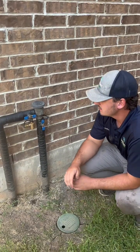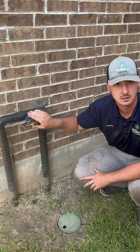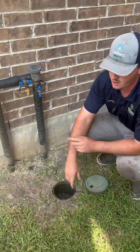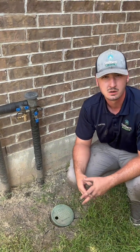What not to do: if you have a Wilkins freeze relief valve, do not turn these handles off — either this one or that one. If you have an isolation valve on the system, do not turn that off either. Also, we have some customers that go out of town during the winter and turn off their meter — do not do that.